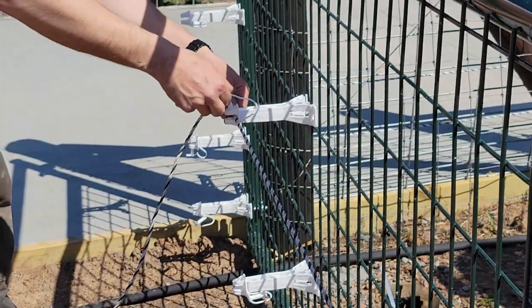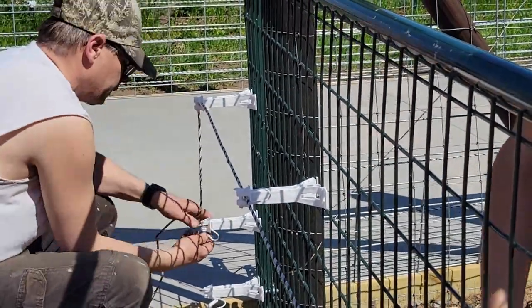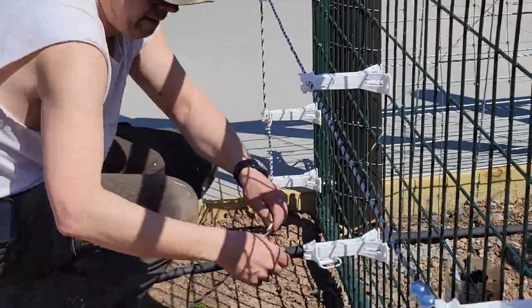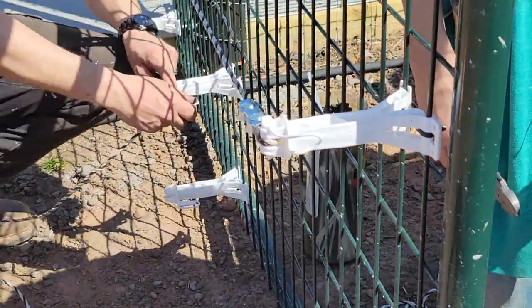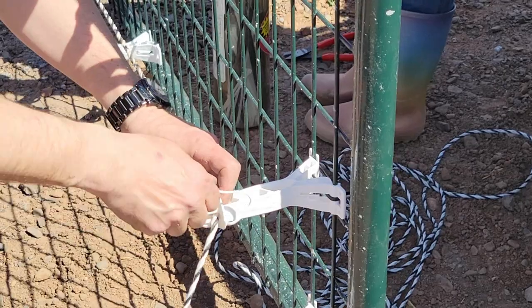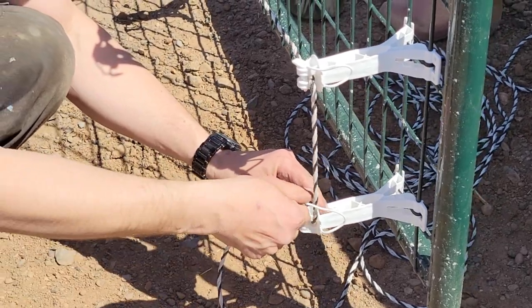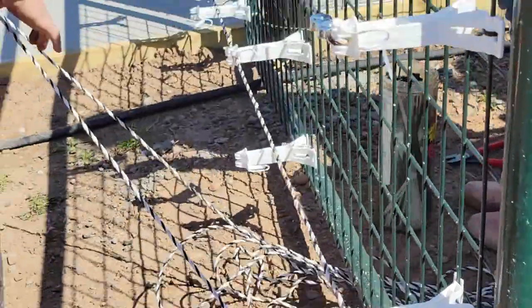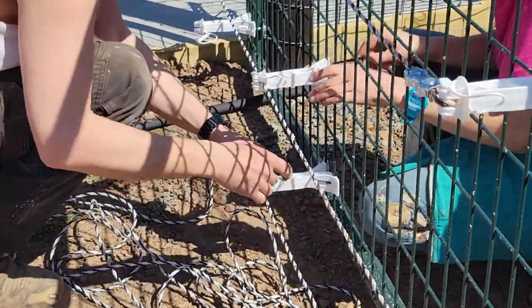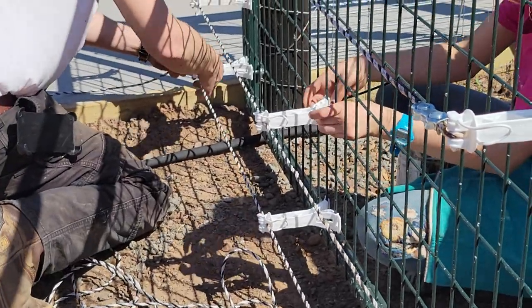If an animal hits one of these offsets and it pops free it would short out, so it's just nice to zip them on so they don't pop free. You can put regular tin wire through them or Intelli rope. I personally like the Intelli rope from Premier — it's said to last almost 20 to 25 years. I've been on this farm since 2005 and I've still got the same Intelli rope up from back then. I'm just threading it through in a zigzag pattern so I can use one strand. I start at the top with a loop and a little splicer, and at the end I do the same thing. That bottom splicer is what I connect to a switch, and the switch connects to the fence, so when you throw the switch the gate goes down but the fence stays hot.